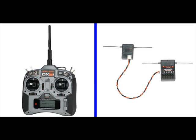Don't think of these as a one-time thing. If you buy this radio system, you'll be able to use it for years to come. You'll have to buy different receivers for different robots, but you can use the same transmitter if it's compatible with the receiver in the robot — so it's a great investment. That's why you buy a good system now. A six or seven channel radio is great; you wouldn't want more than that — it's too complicated. Even if you want to build a heavyweight robot someday, a six or seven channel radio works perfectly.